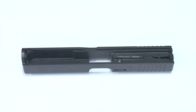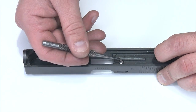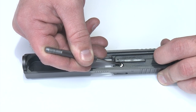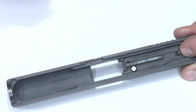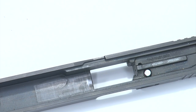Now that we have the striker plunger installed, we're going to go ahead and do a functions check. I'll pull back on the striker just a little bit, take tension off, and make sure the striker plunger moves up and down smoothly. I'll press it in, let the striker forward, and actually press it forward — I want to see that the striker is going through the breech. This verifies that I'm actually able to fire it. I'll release it, pull it back, and the striker plunger should pop up.